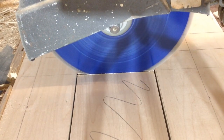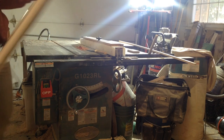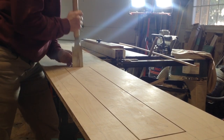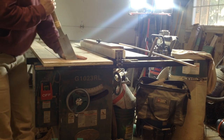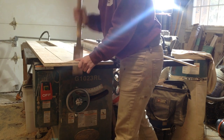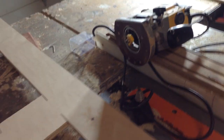There are many ways to do this — you could do this with a router as well. I just think this was probably the easiest way. At the end there will be a little bit of material still left, and I use a handsaw to cut that out. This also makes the piece much lighter by removing a rather large bulk of the center of it. I didn't want to get too thin with the material: I would have had to order new material, and also thinner material bows a lot, and I didn't want to deal with really warped material for something like this.